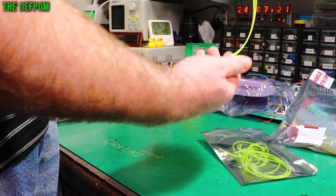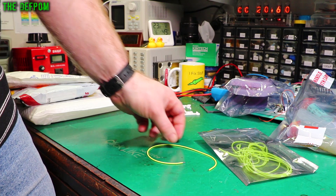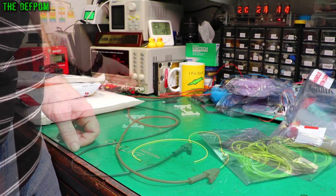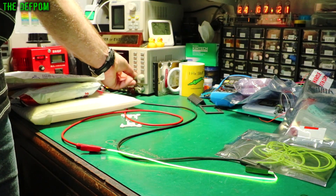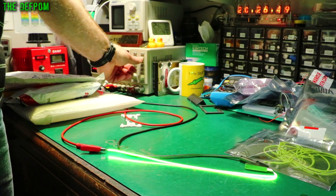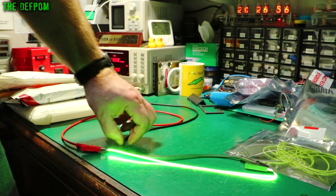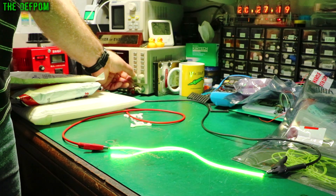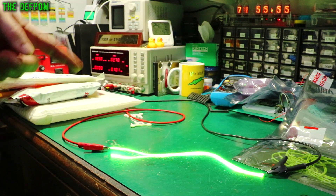These are LED strips — a strip of LEDs on this wire-type material. I'm not quite sure what the spec is. I've got a power supply here so let's hook it up. I'm hooked up to the power supply — 2.5 volts but my current limit is kicking in. Let's go up to 50 milliamps, then 100 milliamps. I'm not sure what these are rated for. So 65 milliamps right now, 100 milliamps — 2.7 volts at 100 milliamps. That's pretty bright now. I might go check the specs and find out what it's supposed to run on.